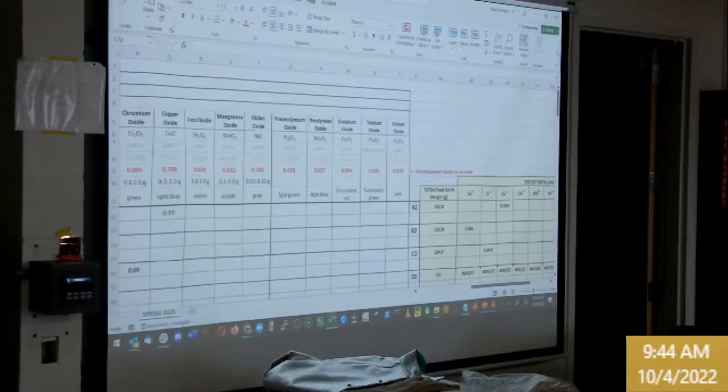This is a spring tensioned door. You just hold here. You may want to wear a glove. I've got various gloves, and you just get used to the way this door works. It's fairly little force, but you're pulling out and it rocks up. So the force is basically this way, but it makes it go up. You probably wear a glove and just be careful about the heat. As soon as I'm clear of the furnace, you carefully reclose that to hold the heat in. Otherwise, we'll be bleeding heat too much, and it causes the glass to start hardening, thickening up, because our pour temperatures get less and less. So that's the door. Then I'll be here pouring the glass, and I'll need someone to operate a torch.